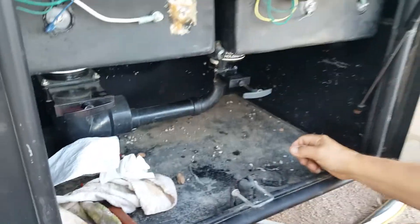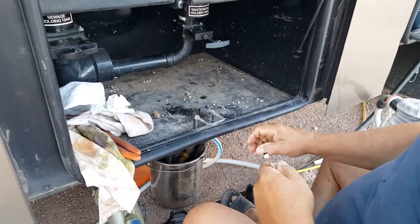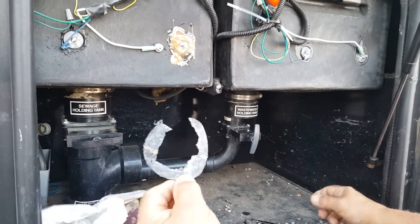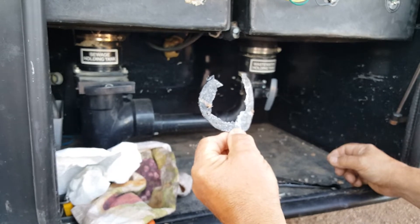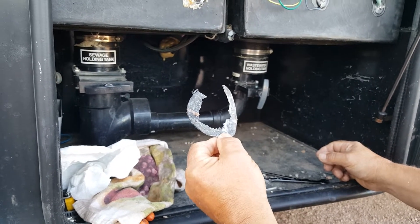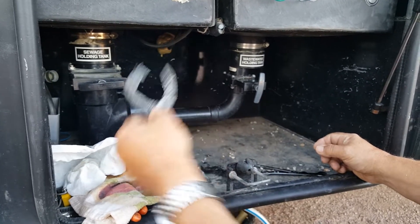Go inside, turn the hot water on, and put some water through. The valve pushes in and closes all the way — that's the culprit. When they installed it, they drilled a hole and pushed the extra plastic right into the tank. After 10 years, it finally worked its way down into the valve and stuck.